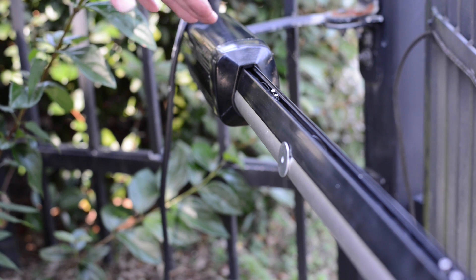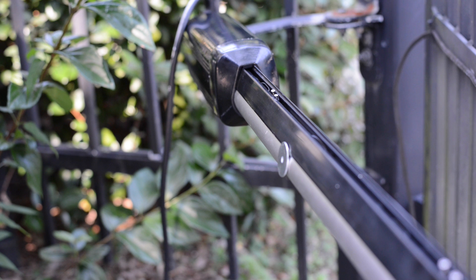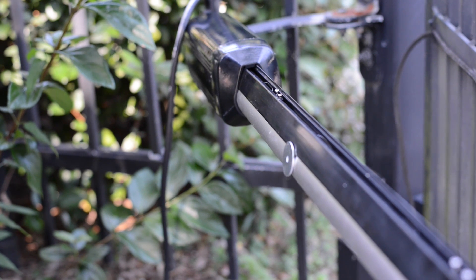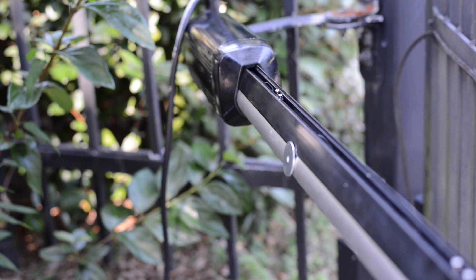This is intentional. The manufacturer wants you to use all the stroke length of the piston, as this gives the gate opener leverage over the gate and makes it last a long time and work reliably. If you use only a little of the piston stroke, the gate is going to move very fast without much leverage, it will obstruct a lot, and it will cut down the lifespan of the gate opener. If you run into this situation where your limit switch cannot go out as far as where your magnet is in the open position, you need to change the rear setback of your gate opener — move that setback further away from the hinges of the gate. Please refer to the setback page of the manual and our setback video to understand how to move this setback further away.